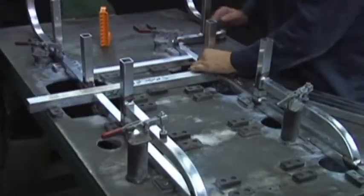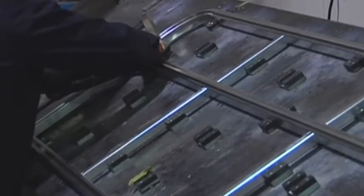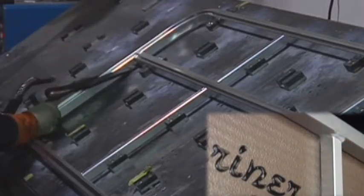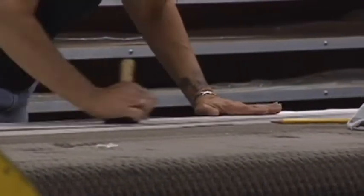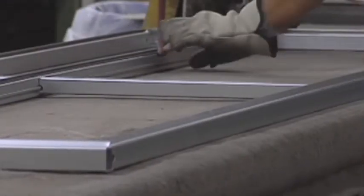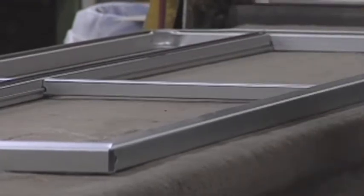The Harris float boat fence is fabricated from Harris-designed extrusion dies. Our welders use customized jigs for each model, and fence joints are MIG welded on at least three sides. We anodize the fences, gates, and ladders after welding, which not only ensures a weld that will survive the outdoor elements without discoloring or oxidizing, but also results in a stronger, less porous weld. Our custom-designed graphics are applied with a high-strength adhesive. Before attaching the fence panel to the rail sections, foam tape is applied to any location where the panel will contact the rail support structure.